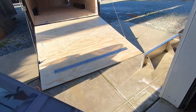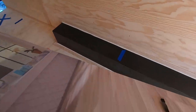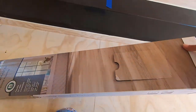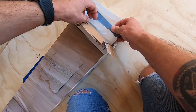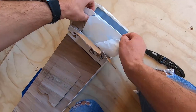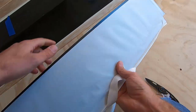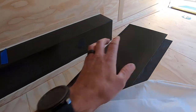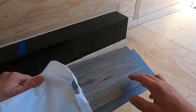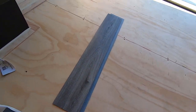I got this all at Home Depot — only $300 for seven boxes. Eight foot wide interior, 20 feet, 160 square feet total. These are 24 square foot boxes, so about six and a half boxes gets the job done. It's got some kind of tongue and groove here — it's sticky on the tongue and groove section, not the back. That's how the pieces are going to snap together. This is the actual floor and I don't see any reason I can't just slap it on the ground.